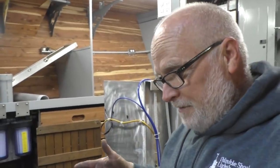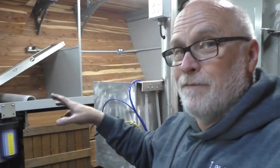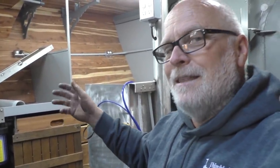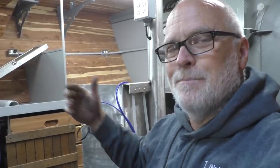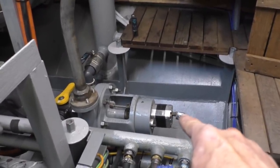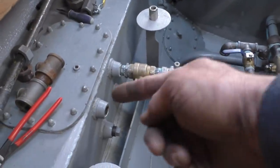So we can have a problem on any one pump and even shut off the supply to it. The other two sections of the hydraulic system are the pressure, which is the lines going out supplying high pressure fluid to the various motors and cylinders and things, and then the return or the tank lines bringing it back from doing that work back to the tank. And like that motor over there, it'll have a pressure line going into it to do the work, and then a tank line coming back to bring that fluid back in through another filter into the tank.